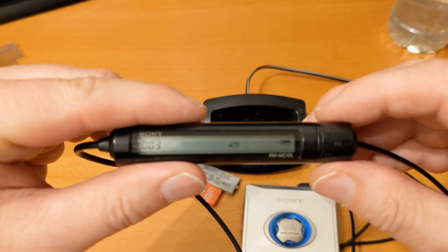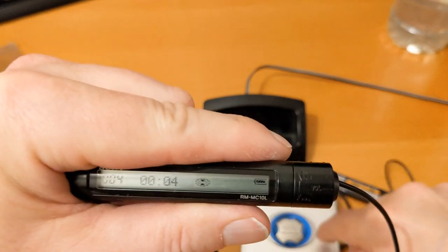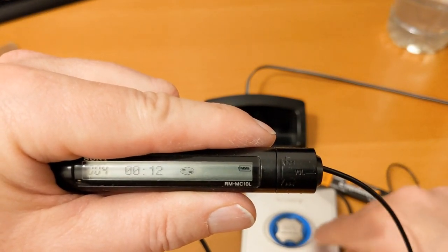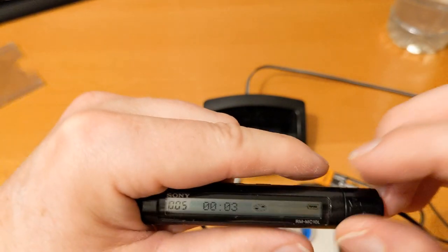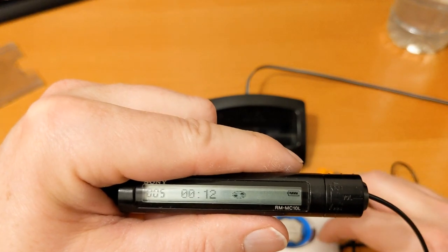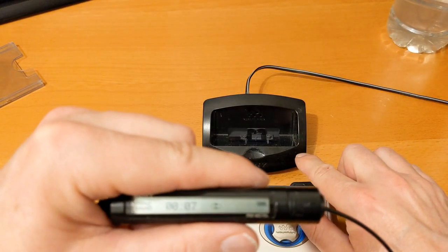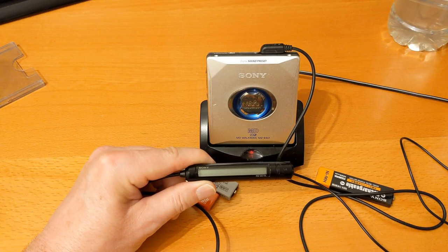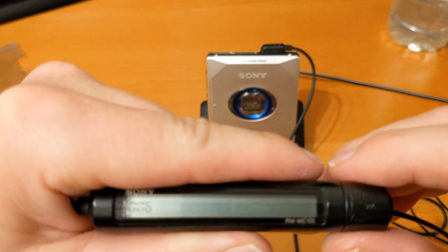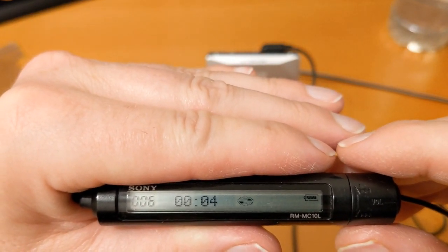With that real-time interlude over, let's take this out and see if this has actually charged the battery. Yes it has — it shows a full battery here because the battery's just been on charge and is probably reading quite a high voltage. But that voltage won't stay high for very long; the battery will quickly drop back to its normal voltage. If you're an electronics expert please comment and let me know whether I'm right on that. The battery needs a lot longer to charge — this apparently takes six hours to give a full charge. We'll call that it for this video. I'll play a little bit of this track to play you out. Thanks a lot — see you in the next video.